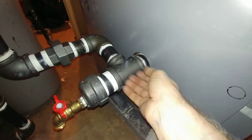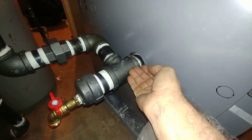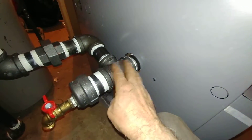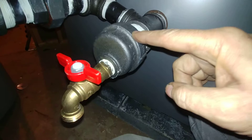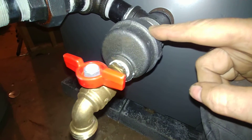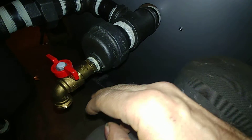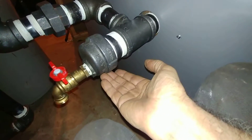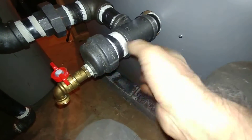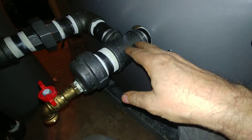This is the return tee. You can probably get away with going in with inch-and-a-half, but we've increased it to two inch. One little thing I'm going to try is using this eccentric coupling — a two-by-three-quarter-inch eccentric coupling — so it drains low on this end, so you don't have a whole lot of water left over.